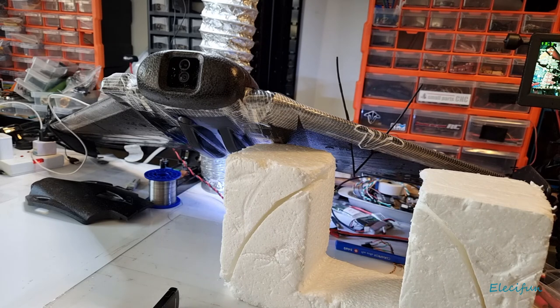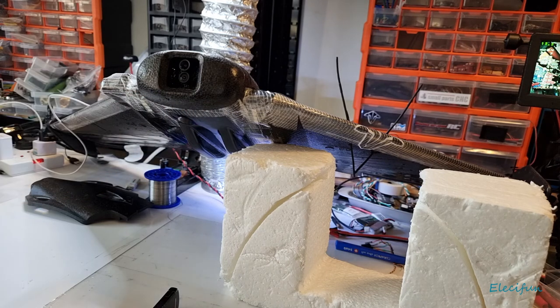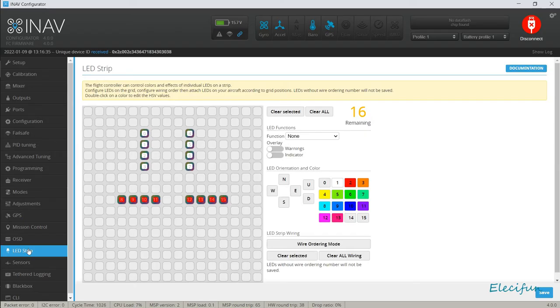Now, I've got to remember, these are daisy chains, but the first ones that get power are the ones down there. So it's possible that we've lost power up the front here, and it's only seen the first ones that I've put on, which means that the front ones may not be working, but that's all right. What we'll do then is we'll just switch that off. Because like I say, it's wired directly to those ones at the back first, and then it comes through here to the front. So there's possibly a break in the cable.